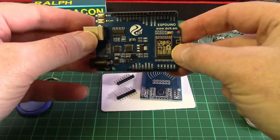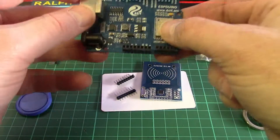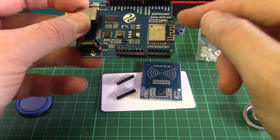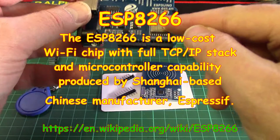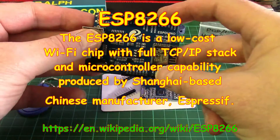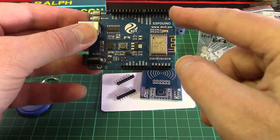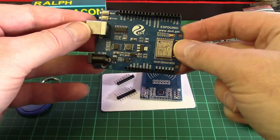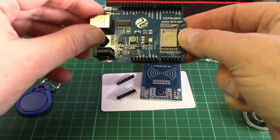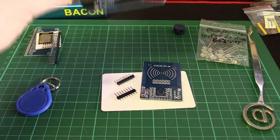This is an Arduino-type board but it hasn't got an AVR chip on it at all - it's got the ESP8266 chip. It's Arduino-sized and has some pins that are sort of relevant to Arduino as well, but it's quite a different board in that sense. You can still compile to it once you've installed all the relevant drivers.